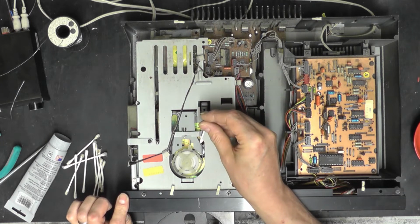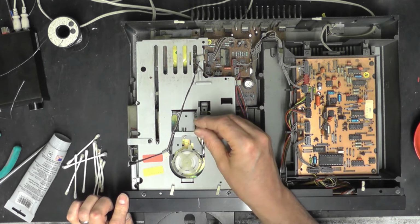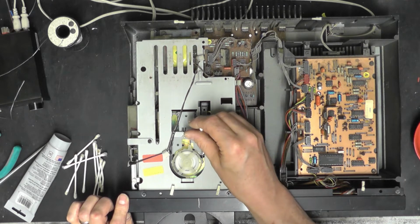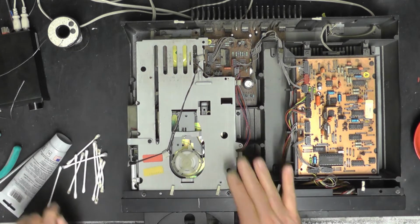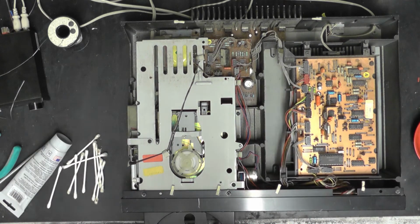You can see that in the top camera, but if you get a cotton wool bud, just moistened with some pure water I use for cleaning the records with, we can just rotate that on the lens there. Don't put any pressure on it whatsoever. It's not what I wanted to do. I'd rather have been able to get at it, but to actually get at the lens, we've got to remove the whole chassis assembly, whereas that should work perfectly well enough.